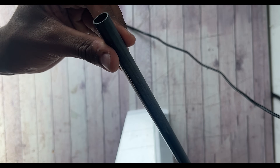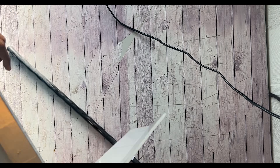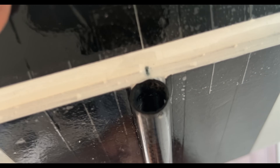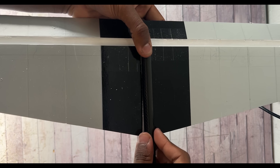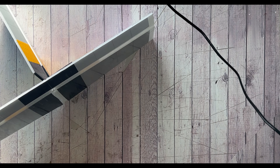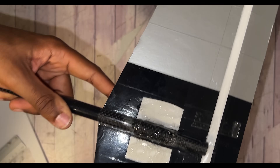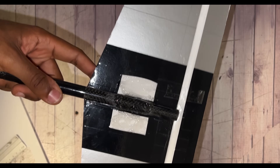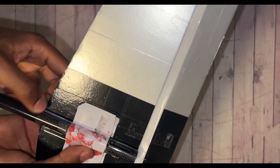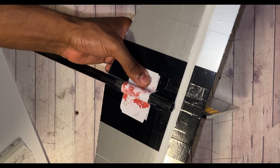After the tail is finished, we glue it onto the boom. I've removed the tape so it's bare foam being glued to the carbon boom. Plastic cards are applied because the tail section is the most crucial part and must be well strengthened. A plastic card is conformed to the shape of the underside of the tail section, glue is added, and the plastic card is put in place.